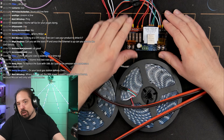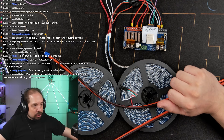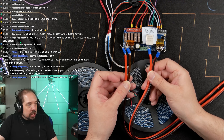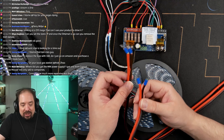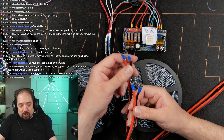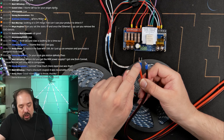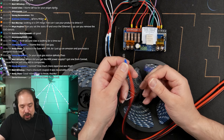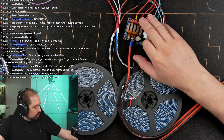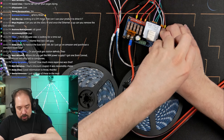These are 12-gauge wires made during a live stream where I showed how not to crimp ferrules and how to crimp ferrules correctly. The bad ones have exposed wire visible where they shouldn't. The correct ones show no wire on the sides and just a little bit at the crimping point. You just separate them and insert into the terminal — these are fully shielded terminals, so no worries about hitting something behind it.